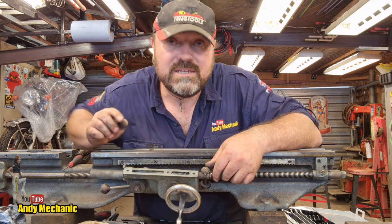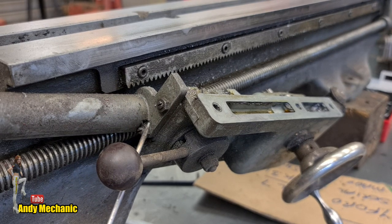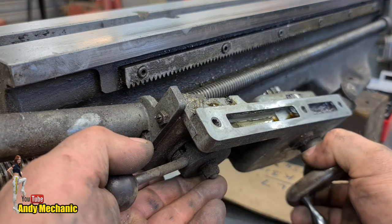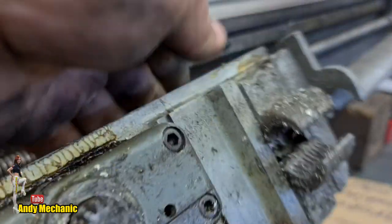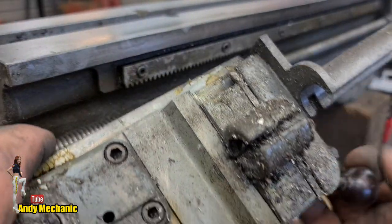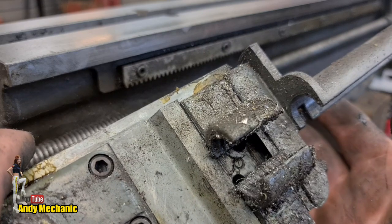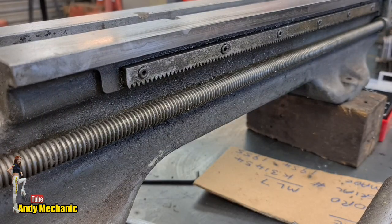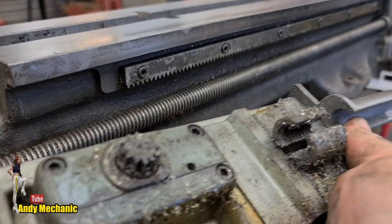Upon closer inspection, we've got this lock nut - there's a cutout on this tube and it's a bit dodgy to be honest. Maybe we can just give it a wiggle and it'll come off. Oh there we go - look, perfect! That's how the carriage is disengaged and engaged to that screw thread. Basically it just releases its grip on the actual rotating bar - this bar here just rotates around like that, and then when this is engaged it just moves either down or up depending on the rotational direction. Very very simple. The good news is the apron is off. The bad news is we have to strip it - but that's going to have to wait until the next video because this one is already too long.